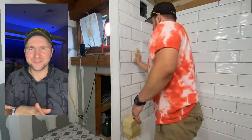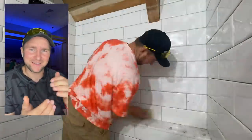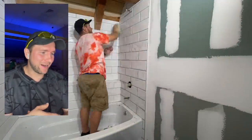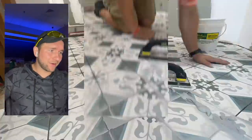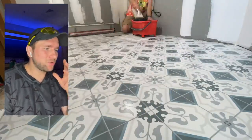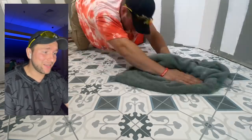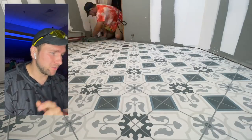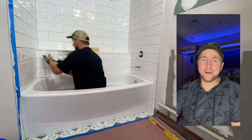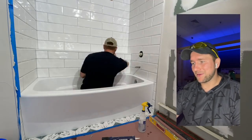We were constrained with the homeowners right there. But we have a YouTube studio bathroom I've built — in the next couple of weeks we're going to start building mock bathrooms and doing real in-depth tutorials on all this stuff. Here we're grouting. Nothing really special — you're just working into those grout joints, making sure you work the grout into them. Then wipe it down two times with a sponge. Bring in a dry towel that gets rid of basically all the hazing — super important. Must use. And last, in the corners, put some silicone-based caulking that matches the grout color and it'll look beautiful.